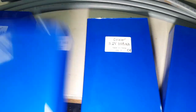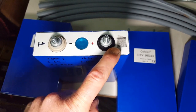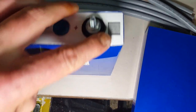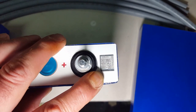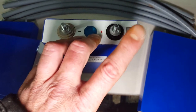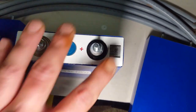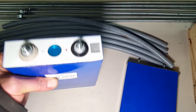One really useful thing I forgot to mention: LiFePO4 cells always have a QR code on the top. The Off-Grid Garage Australia YouTube channel — one of my favorites — has a link in most of his videos to an app that's a QR code scanner for LiFePO4 battery cells. It should tell you the date of manufacture and what the cell was tested to. I tried that app on the QR codes on these cells and it's completely fake — unrecognized, does not exist. Very advisable to download that app and use it before you buy.